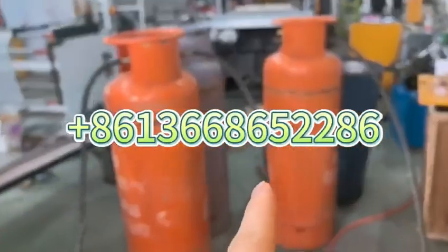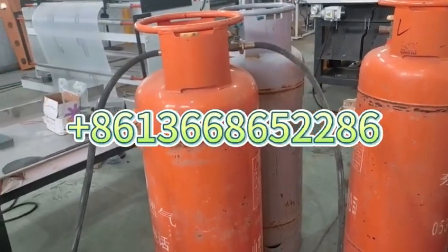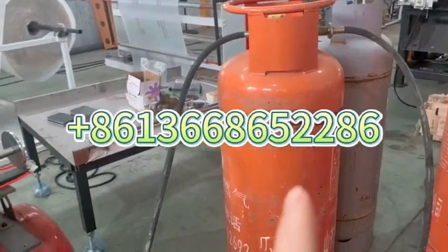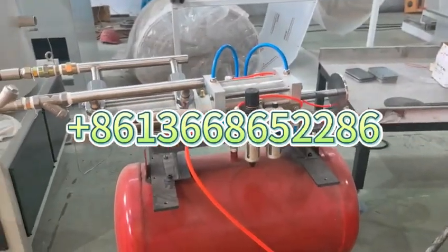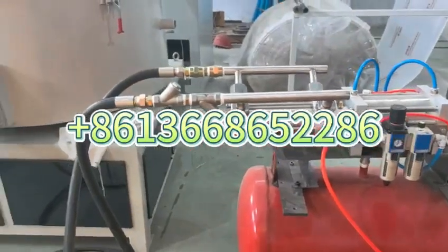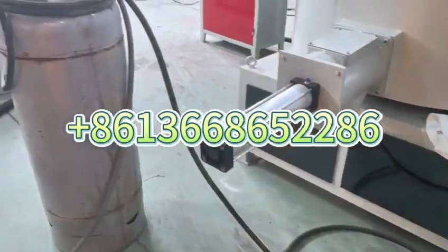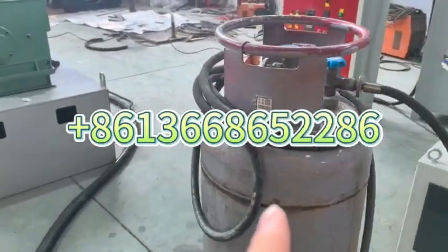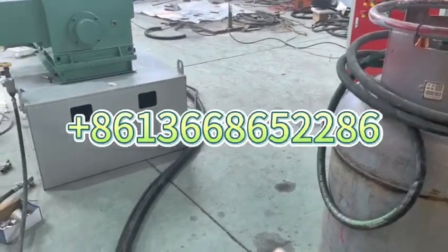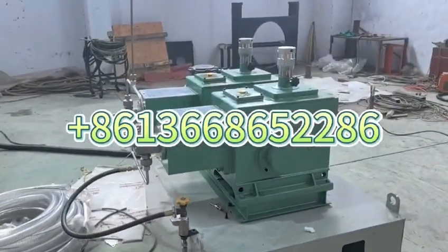The tank with the gas — on your side, you can prepare a big tank for gas. The gas goes through the pipe to the booster pump. This is the booster pump, to increase the gas pressure to 1.3 MPa. Then it goes to a tank to keep the pressure stable.